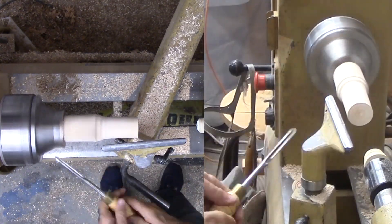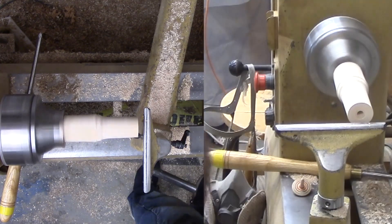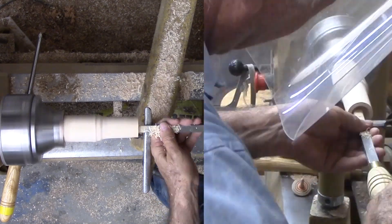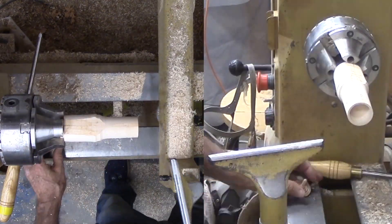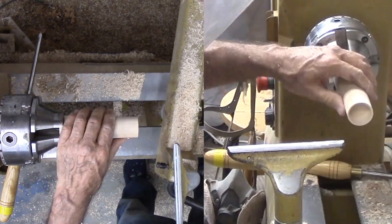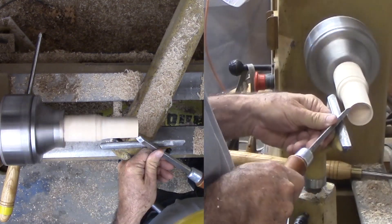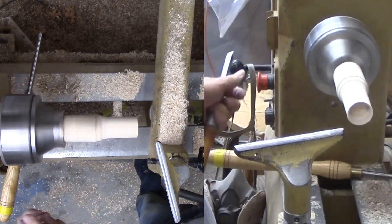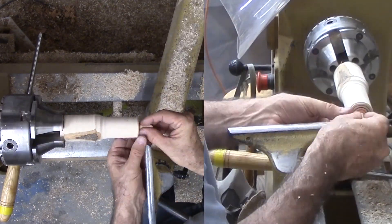What to do with all that wood still hanging out from the chuck? How about a small box? The top will serve as the lid. I drill the very center then switch to a small box scraper for hollowing. I need just a little shaping to match the top for the lid. I change over to the exterior, mark the depth on the outside, then mark that point with a shallow parting cut. With the limits established, I use my skew to form a top and bottom bead and remove the wood between. Then a quick sand and apply a mix of beeswax and mineral oil for a finish. Finally, finish parting off the box portion.